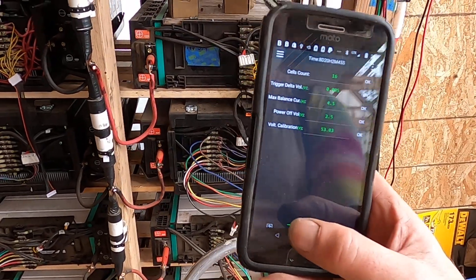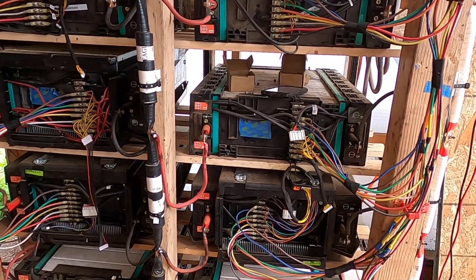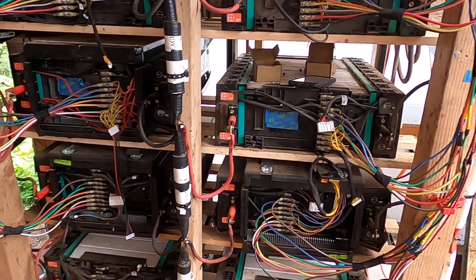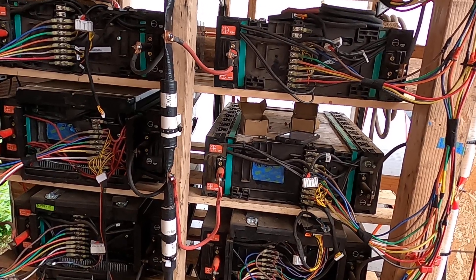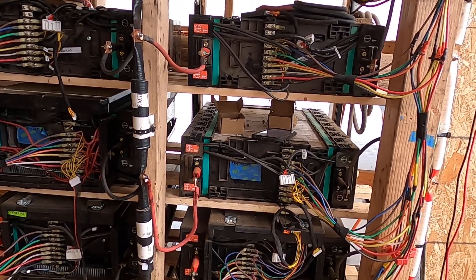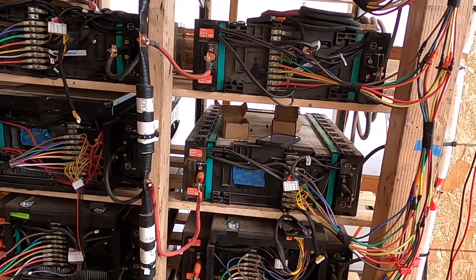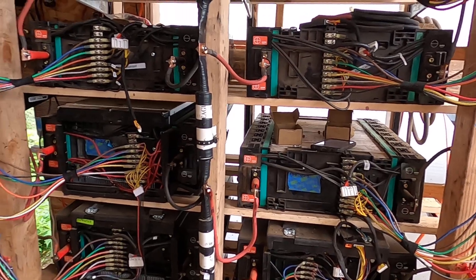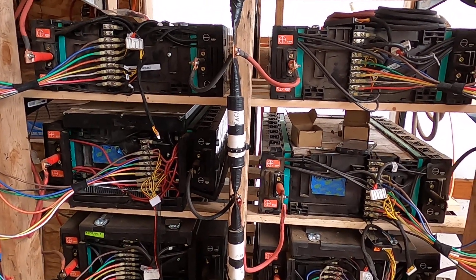This has been working fabulously. It only balances about 20% of the time now — the rest of the time it's below the trigger voltage — hovering around a 0.004 cell delta. I'm extremely happy and can't wait to do a capacity test in the next few weeks. I expect capacity to be significantly improved over individual pack capacity, since I'll be able to start from a high point where all cells are fully charged and discharge down to a low point where all cells are equally discharged — giving a really accurate reading of the battery system's capacity.